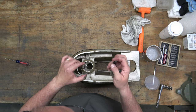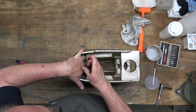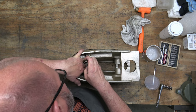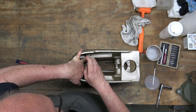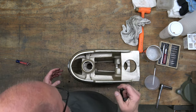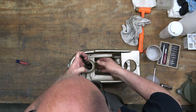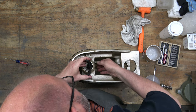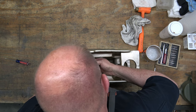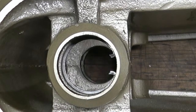Then we're going to install the outer snap ring. There's a recessed area in the bottom bore of the spindle pulley bores that it sits in. This is what the bottom pulley of the spindle pulley assembly rests on — I have a whole video about how all that works inside, I'll put a link here. If you don't have this installed, the spindle pulley assembly will sit too low in the drill press. There you can see the outer snap ring in its recessed area.